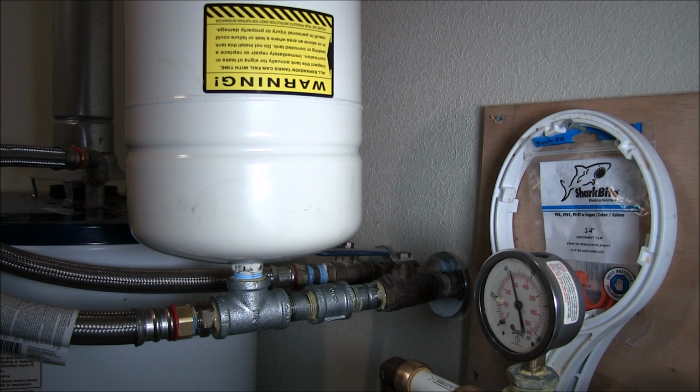And after any plumbing job, especially when you're working with galvanized pipe like this, and it's an MPT pipe tap, everything might look good. Come back and check it in about an hour or two, and make sure it's not leaking. You might have a very slow leak. It's just good to check it, and if you do, then you're going to have to take it off again, re-put the new pipe sealant on there, or Teflon, and tighten things down better.